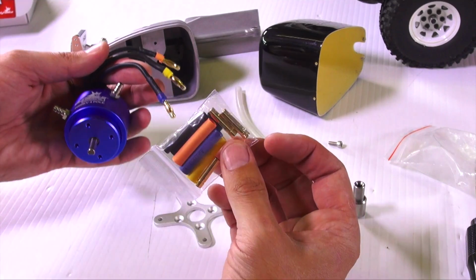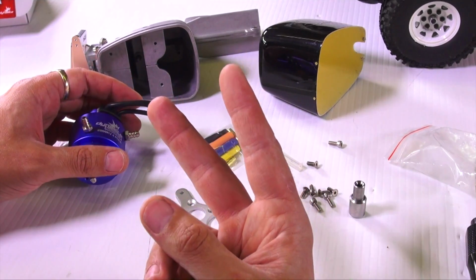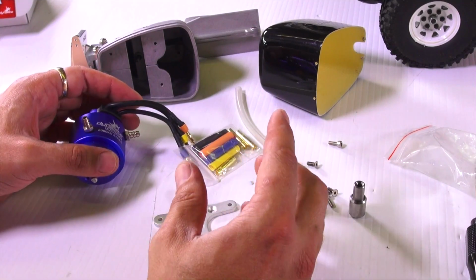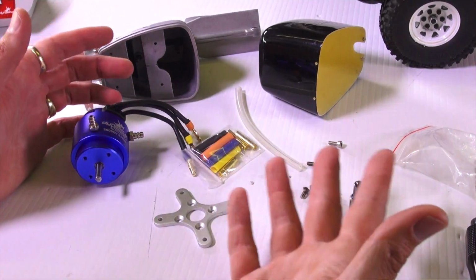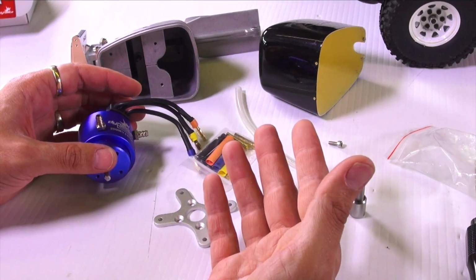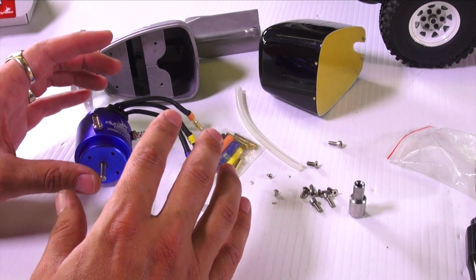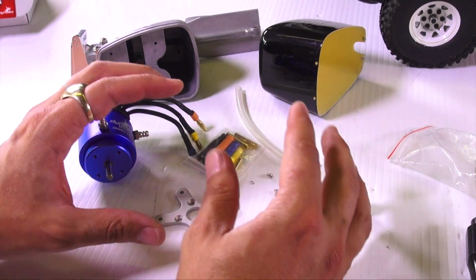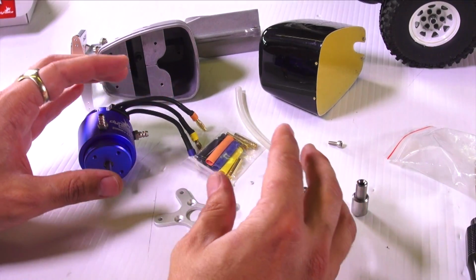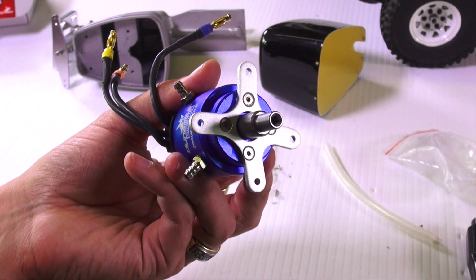A waterproof brushless one, of course, which means, if you guys hadn't thought of that, I'm actually going to need 2 ESCs to run this whole truck, and they're going to have to run separately. So that'll be fun for me to wire up. I will be switching my radio over to a dual stick radio, basically set up on the left side for the truck to be run, and then of course for the outboard motor. I think that's the way I'm going to go. We'll see. Ta-da!